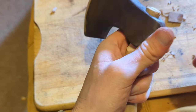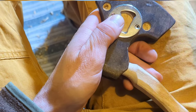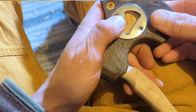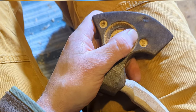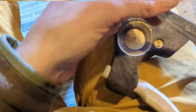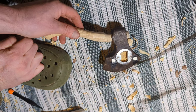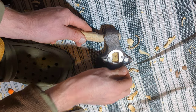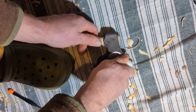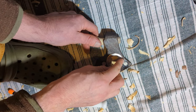Sometimes the charring can slightly change the shape of the pre-drilled hole and your bottle opener will not fit perfectly. Line it up, press it to leave an indentation showing what needs to be removed, then very gently use the tip of your knife to increase the size a little bit. Then add a drop of super glue to each magnet hole, push the magnet in — sometimes you need something hard to force it flush — and then put in the bottle opener and the two screws.